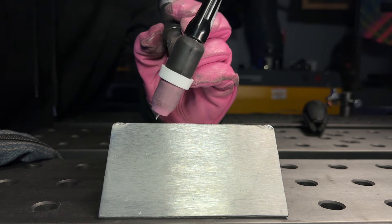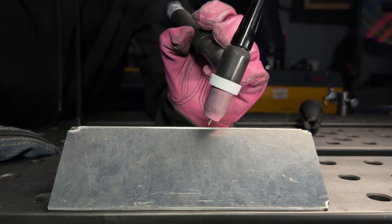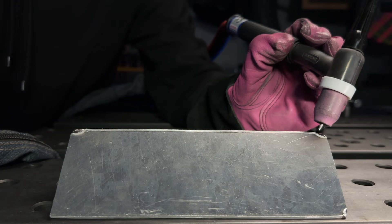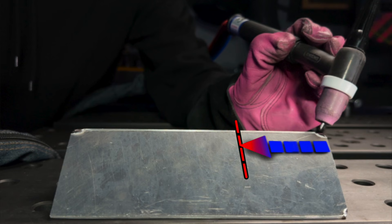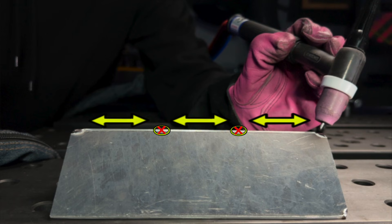Working with smaller pieces you'll probably be able to stay more comfortable because there's less distance to travel, but when you're working with something a little longer we really have to take this into consideration. Getting set up to do a dry run, your ideal distance for comfortable travel is about this long before you start to get uncomfortable. So when you are assembling the joint, I recommend putting a tack there. We essentially want to make sure that we break all of our practice passes into passes about that length — whether it's an inch or two inches — so that the comfort as you travel is perfect from start all the way to the finish.